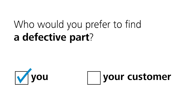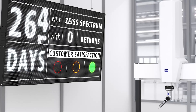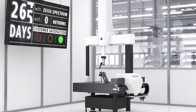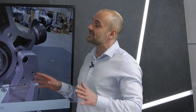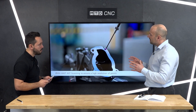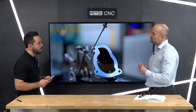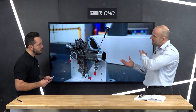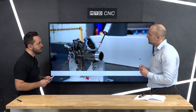Scanning is a big feature of the Spectrum. Zeiss are synonymous with scanning — the first CMM system they ever produced was launched in 1972 and that was a full scanning system, so they've always come from that direction. Couple that with being in tactile measurement for over a hundred years; it's a natural progression. The system uses our XXT measuring probe head, a passive measuring probe head that has the ability to assess the quality of data before it's used in the actual calculation.